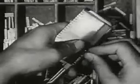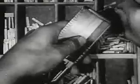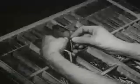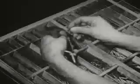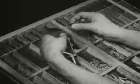This is no lazy thumb. Notice how it slides each type squarely into place. Concentrate on looking for the face and the nick as the type lies in the case. As soon as your fingers reach the type, spot the next letter. As the type is carried to the stick, turn the nick away and the face up. If you fail to spot the type correctly, you will have to look to turn it properly. Then it will take extra time to look for the next piece of type.